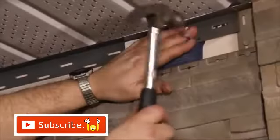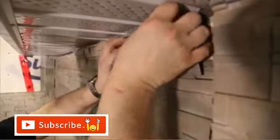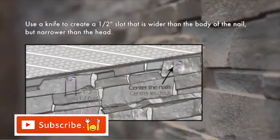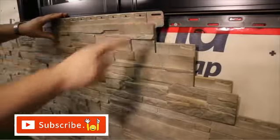For a finishing touch under the soffit, first install the Novi trim base before the last row. Then measure 1/4 inch from the inside of the trim to the panel's insertion slot of the previous row. If you need to attach panels where the nailing channel has been cut off, use a knife to create a 1/2 inch slot that is wider than the body of the nail but narrower than the head. Although not set in installation holes, this type of slot will allow expansion or contraction movement. For underneath windows, repeat the same steps for installing under the soffit.